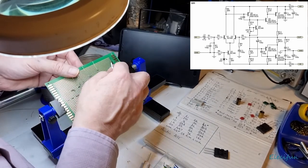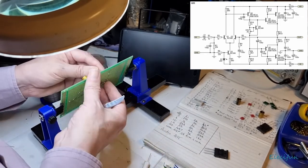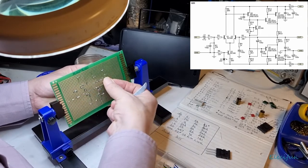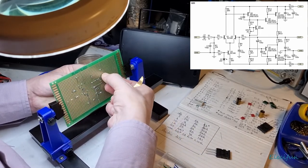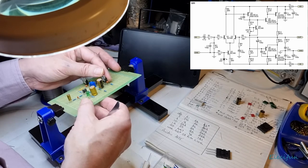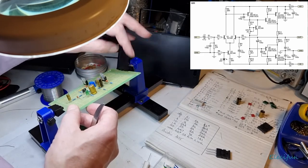And then this can be bent across to go onto a resistor there. So we'll just bend that across now, just to get it more happily in situ. There we go. Just bend that down from the resistor. It's got a little tiny bridge to make with solder, not a problem. And before I do that, I just want this capacitor to drop a bit closer to the board.